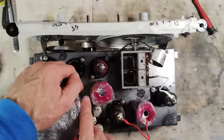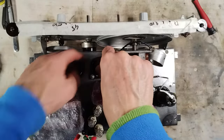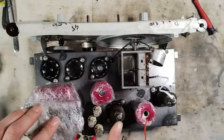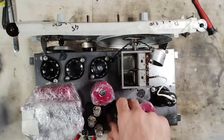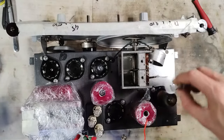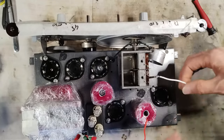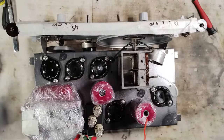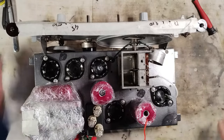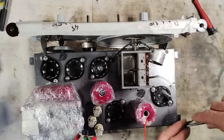This is a demonstration of how the tubes should be extracted from and consequently also inserted in the sockets. The tubes need to be tilted, therefore the chassis should also be organized so that the movement is possible without touching anything else around. Unfortunately, in this adapted chassis, the rectifier tube, as well as the final amplifier, which are also larger and taller than the others, cannot be tilted at all, and their safe extraction could be difficult.